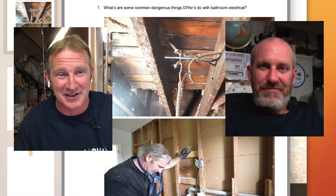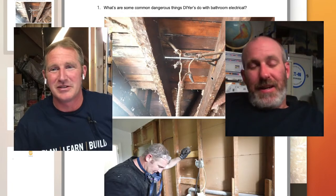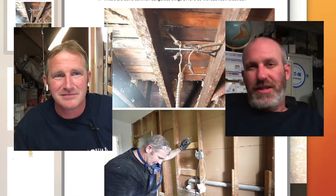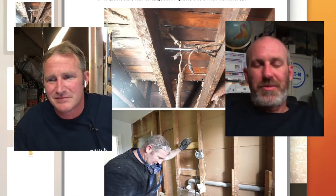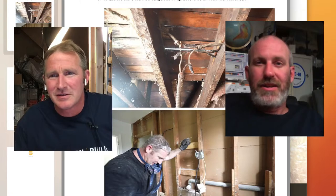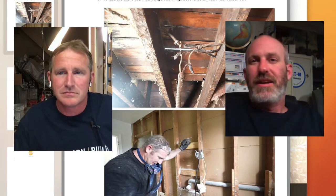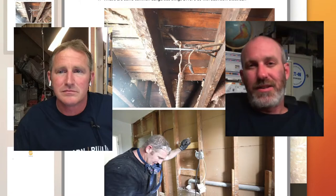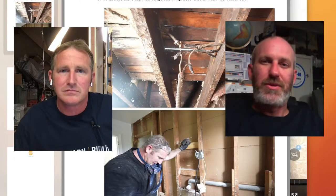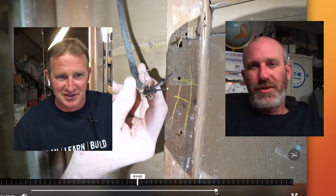The wattage is a problem. The GFI actually does solve some of the problems if you have a circuit without a ground — if all you have is a hot and neutral, you can put in a GFI outlet and that simulates a ground. The GFI outlet measures between the neutral and hot leads, and if there's any imbalance — meaning something is leaking to ground — it will shut off. So technically a GFI is a simulated ground, and it's exactly what you want on old wiring like that.